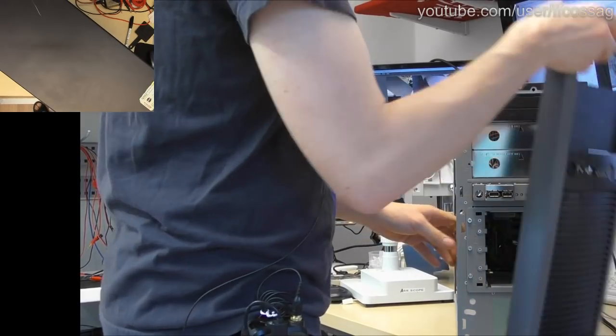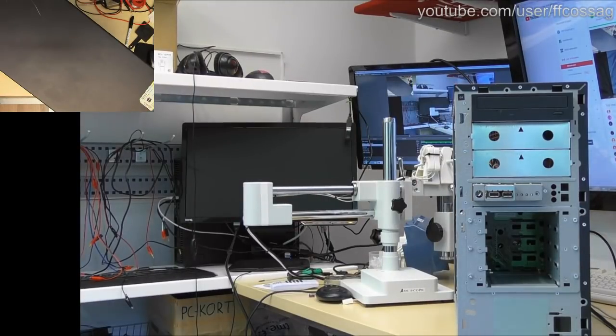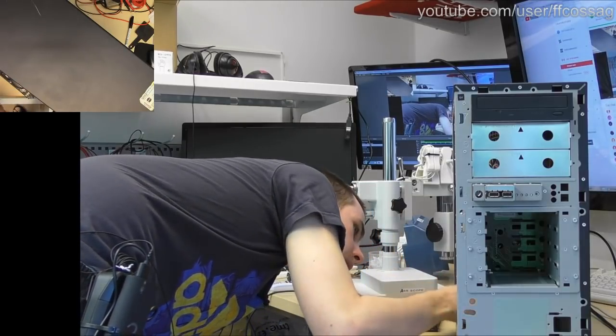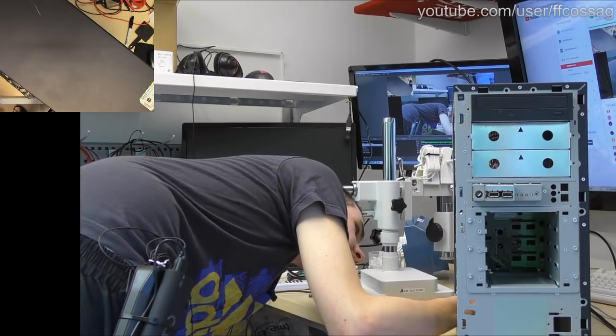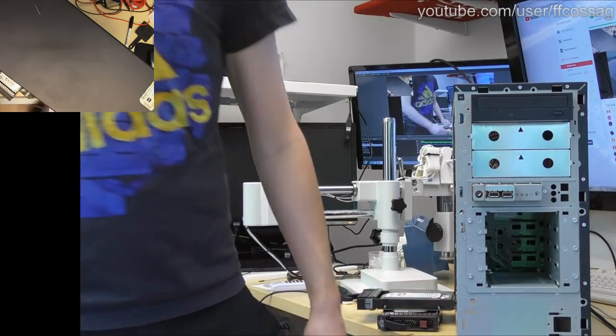Let's get one of the drives that's supposed to go in this thing installed. I want to make sure that the RAID controller actually sees them. Basically forced to go through the RAID controller as well, because I don't think this thing actually has any SATAs. Does this thing have SATAs on an Intel controller? I don't think it does. It's got an internal USB. No, it's only got SAS. That's annoying. That's super annoying. But this thing's just going to eat 2 terabyte drives anyway, so it doesn't matter.